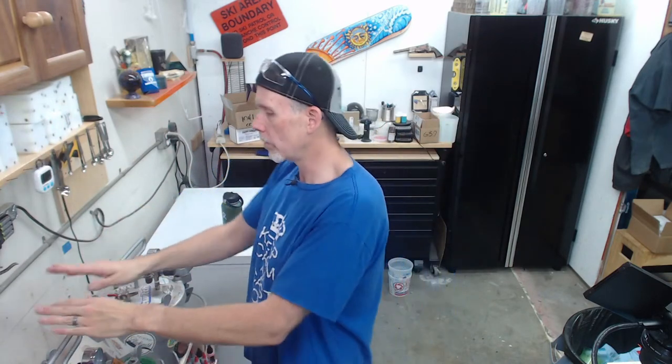Now with Deep Pour, and I haven't experimented with this because frankly, I don't have the patience to wait 2 hours before pouring, but I have a feeling that gel period is going to be even longer with that stuff. You can wait and wait and wait, and it's going to be kind of a weird thing, which may be easier. You may have a much wider window of when you could pour and not get bleeding. I don't know if that's the case. But the other thing is it's also going to wait much longer. If you started pouring at the very beginning of that gel period window, it's going to have a lot more time to sit there and possibly move around and do stuff